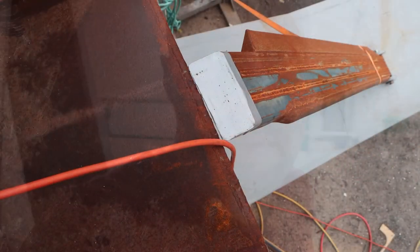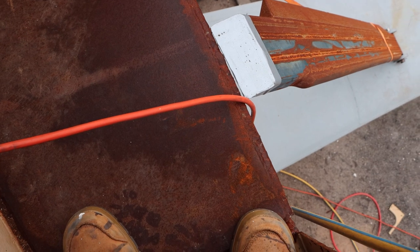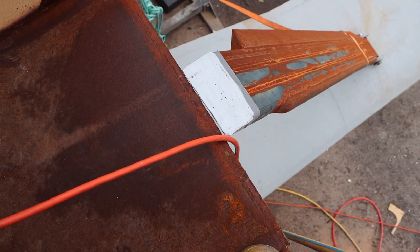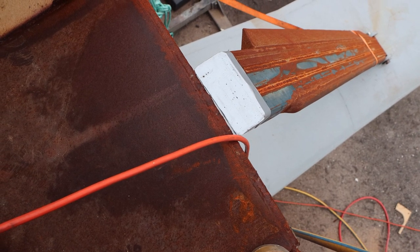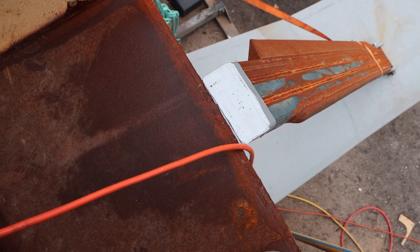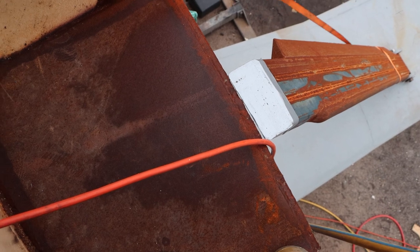While he's doing that, I'm going to go around the other side of the boat to the top of our second arm. I need to clean off the doubler, get rid of the surface rust and get it ready to weld, then put the top plate onto this arm. We've got a bit of tape on there to stop rubbish going down inside the tubes while we weren't working on it. We'll rip that off, get the top plate on, start making the same mountings on this side, and get the mag drill out to drill this side as well.